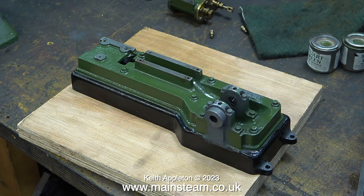In the previous episode, in an absolute frenzy of non-engineering, I made these bearing replacements. The bearing at the flywheel end is quite special — it's much bigger than the one at the other end — because the original bearings wore out fairly quickly. The flywheel fitted to this engine is different to the ones that used to be fitted to Stuart S50 engines; I confirmed that by phoning Stuart Models. That's why I really beefed up the bearing that supports this flywheel.